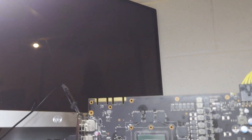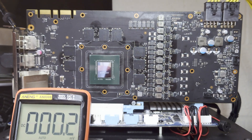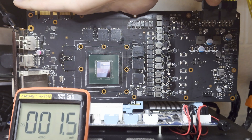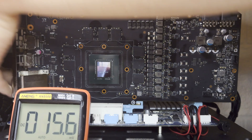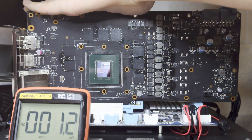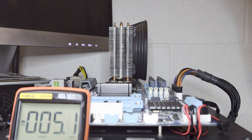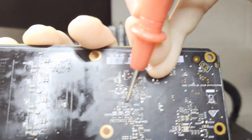The gate reads 10.7 volts instead of the expected 10.5 - that's fine. Vcore is present, and better yet we have an image. There's a BIOS splash screen - our card is now in a bootable state. All that's left is to put the cooler back on and stress test it. But first, let's go over the diagnosis one more time since the enable signals can get pretty complicated.